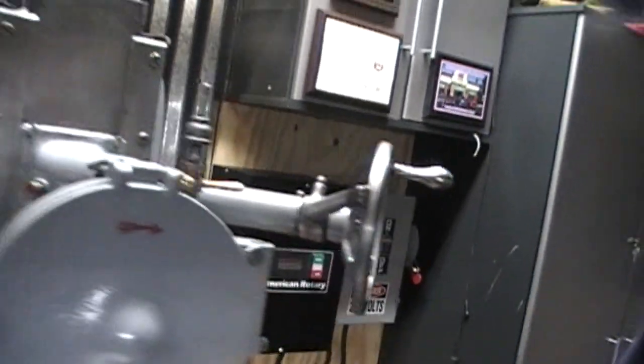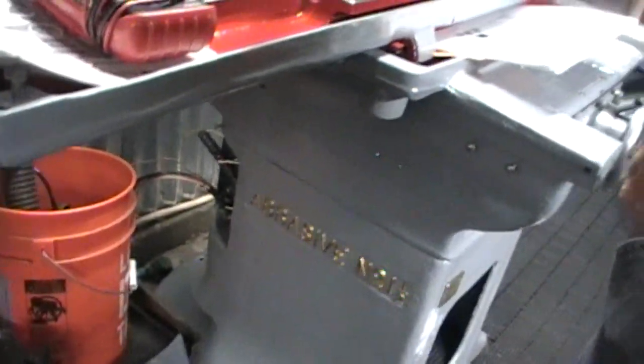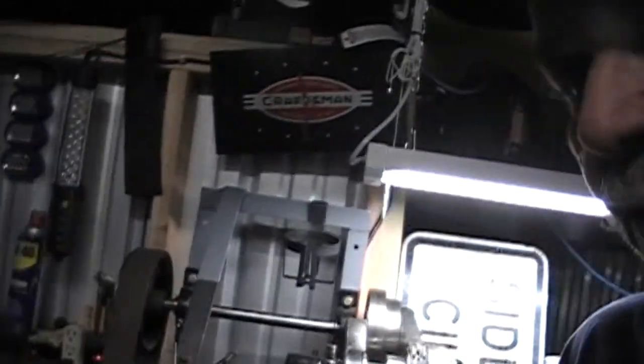All I have to do is wire it up down there. The only thing about that is when I disconnected the relay on the back there, I didn't write down where the incoming feed is. I trimmed it off with about six inches on all the legs, but it's got three sets of three. And it's all color coded — that's not a problem. But I don't know which one's coming in and which one's going to the switch and which one's going to the motor. So that's as far as I got.